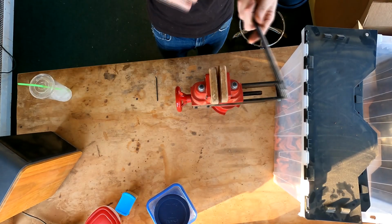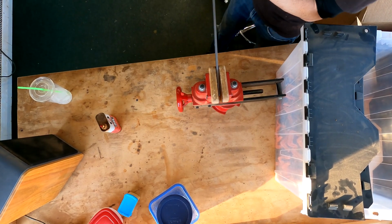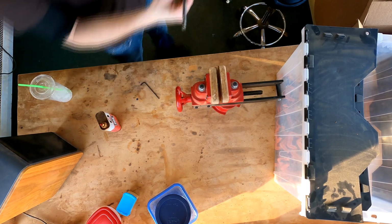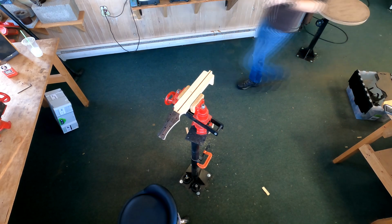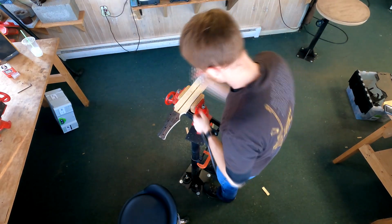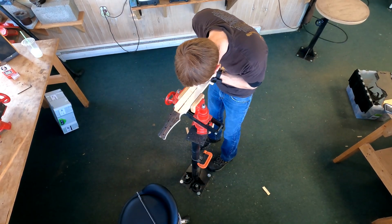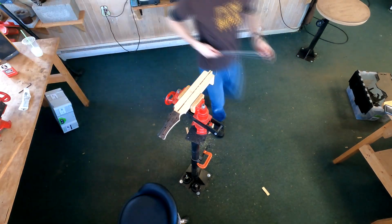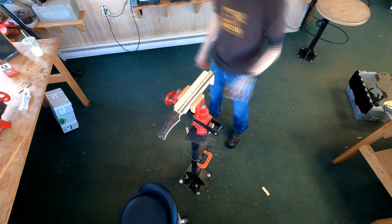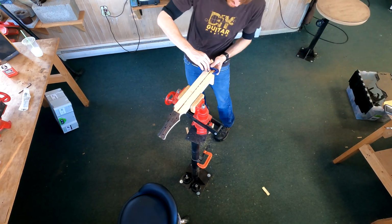Before I install the truss rod, I like to add just a dot of oil on the threads of both nuts at either end of the truss rod. And I'll leave this for you guys in the comments. I'm adding regular old bathroom and kitchen silicone caulk to the bottom of my channel. And if anyone can figure out why I'm doing that, go ahead and please add that into the comments and let me know what you think. Take a wild guess.